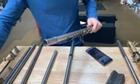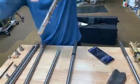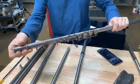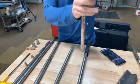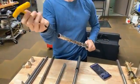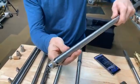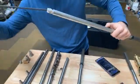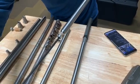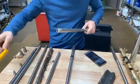What's cool about this is if you're doing some ragging or some dent work, this will keep the flute on there so it can't come off. It also allows you to rotate it, and it stays secured on your vise. Even with the rotation, it's not going to come off. You turn the little stabilizer, it expands, and it holds the flute in place. Did you mention that you can't over-expand it? The two metal parts will hit and it will bottom out inside. We accept no liability for damage to the flute you're repairing, but it's designed to limit that: the metal parts come together and it won't overextend, so it can't bulge out. That's also good for ragging.